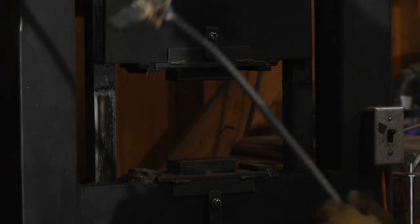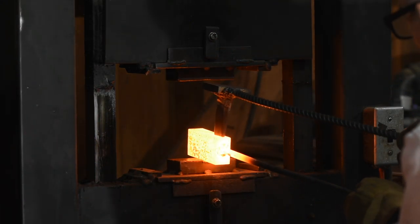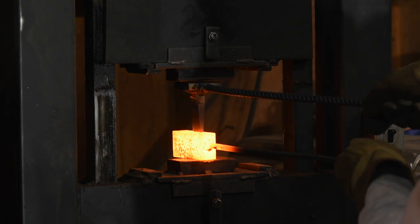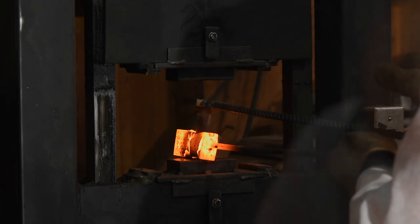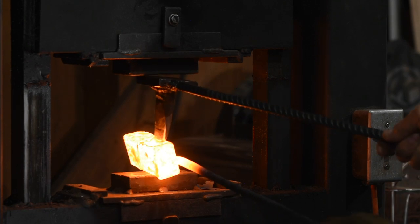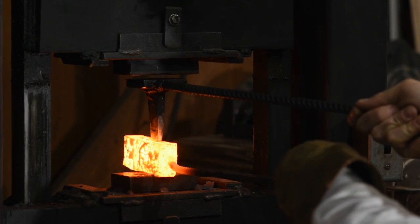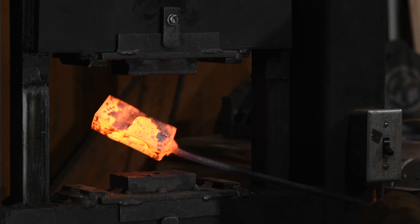The handle's bent so that it stays out of line with the handle of the axe head. If they line up, they'll not only interfere with each other when you're working, but the force of the press can potentially cause serious injury to the smith. The first time I plunge in, I make a rookie mistake and go a little too aggressively, and the tool gets stuck. A little bit of banging and swearing fixes everything, but I'll go slower on the next plunge. I'm working from both sides, alternating one to the next. If you only go from one side, it's easy to get out of line and end up with a cockeyed hole. All we're trying to do here is to get an even hole all the way through. We'll enlarge it later.